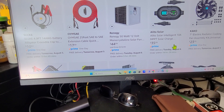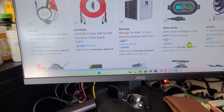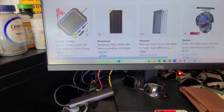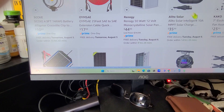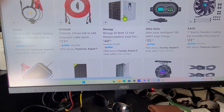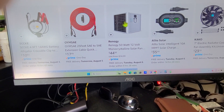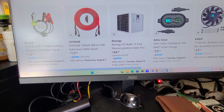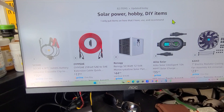You can get a battery tender or whatever, but if you've got good sun and want to leave it out there, go for it. The old 20-watt panel on my store gives maybe 1 amp max. This new unit goes up to 10 amps — you can put a couple hundred watts of solar panels on it and actually charge the battery, not just trickle charge it. 50 watts works fine if it's not fully depleted; 100 watts is preferable. Thanks for watching and we'll see you next time.